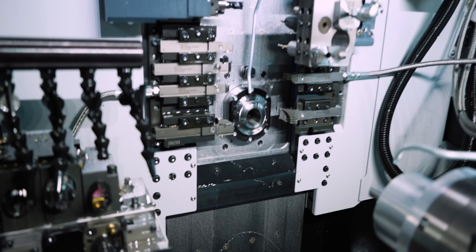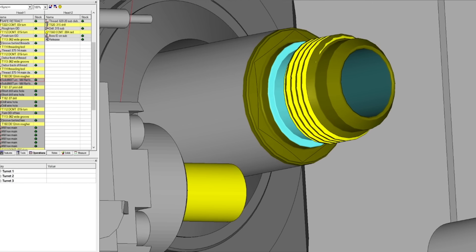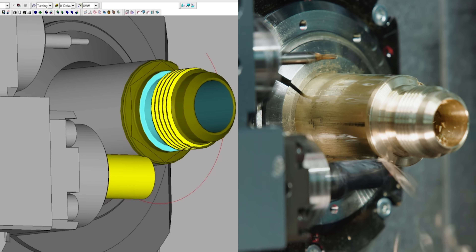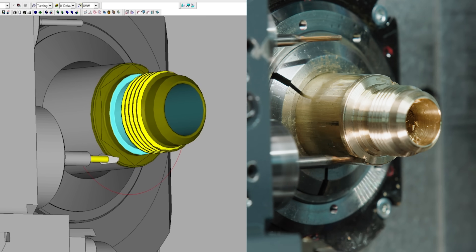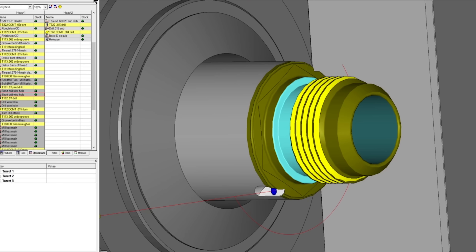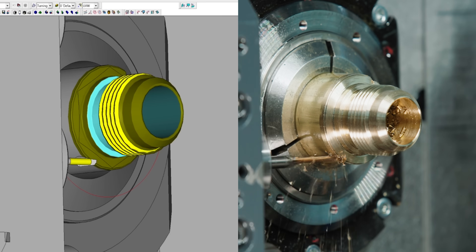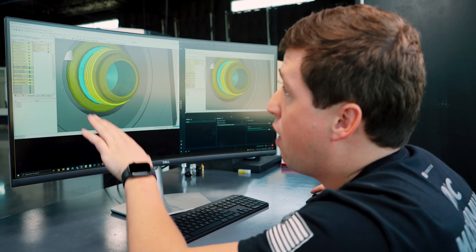It's gonna be a lot easier to show you through the simulation exactly how I'm doing this. You can see this is our GT32. It all starts with my end mill — we can see how I snuck in here and did this. The first thing I'm gonna do is stab these little flats with the end mill, hitting both sides. After that comes my pilot drill — as you can see, it doesn't go very deep, only in about a millimeter. It's just there to give a little short bearing surface, a guide hole for the longer drill. Now I come in with the longer drill and pop the actual wire hole in — I drill both sides, and it goes pretty deep. So now my wire hole's in there.